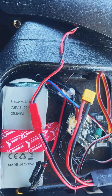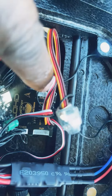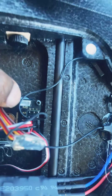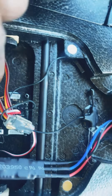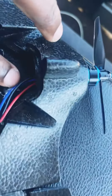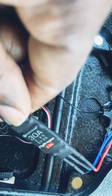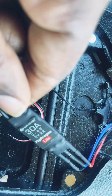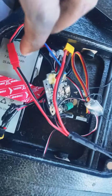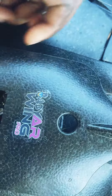There it is — we have the 2S 3400 pack in there, there's the Zod Copilot with no GPS. You can see there's no GPS cable. ExpressLRS 2.4 — just got it glued down inside of there. Stock plug-and-play 30-amp ESC, and that's it. Weighed it up, it's about 317 grams altogether.